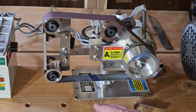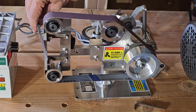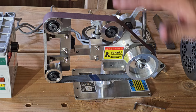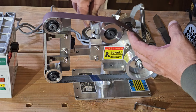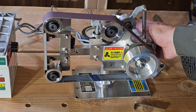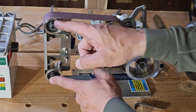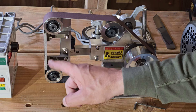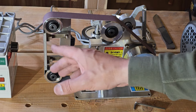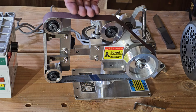You can see the flat platen. If you're knife sharpening, knife making, making handles, or whatever, you can rub them on the flat platen for your sharpening or grinding. Now let's look at the features: here's the tensioner, the 550-watt sewing machine motor drive wheel, the tooling arm, and two wheels. This platen is removable — you can pull it off, swap in a different style, or totally get rid of it and go slack belt. You also have the option of going slack belt up in this area.